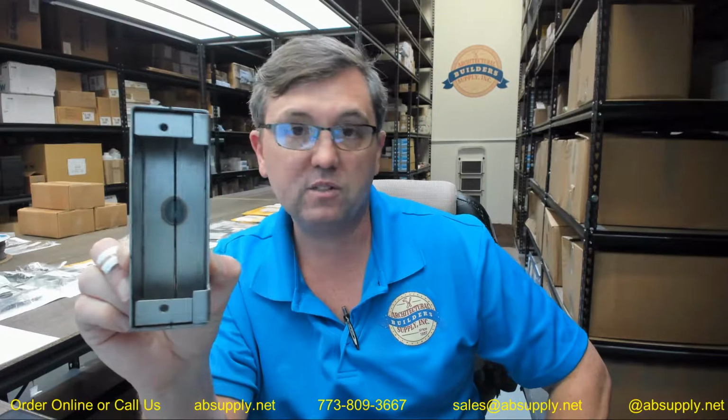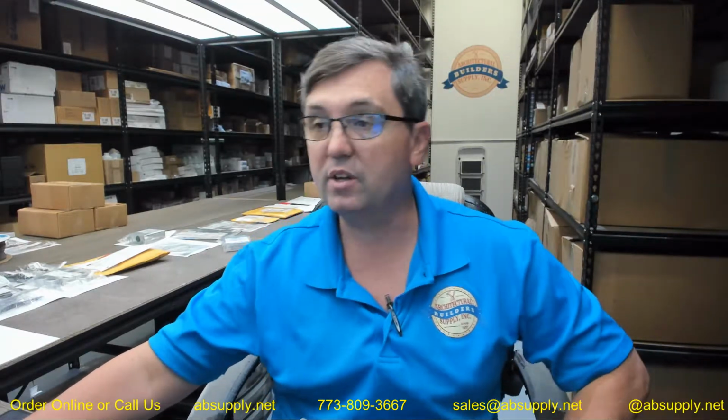So this is an electric strike box. This is for the Adams Rite 7100, 7101, 7140. The HES 5000U with a 501 option, that's the faceplate. A Trimec ES 100, I'm not familiar with that brand. A Rofu 2402, okay. Dimensional properties, and there is an image below this video called Cut Sheet that's going to show us some dimensional properties.